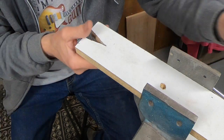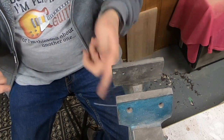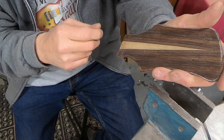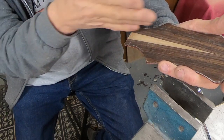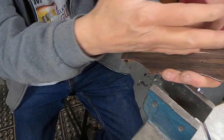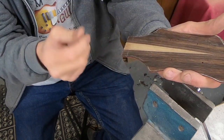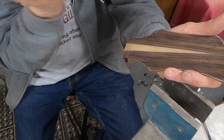I don't love cutting it with an exacto blade. The plus side is that these aren't extremely straight right here toward the end because I was having to angle my saw and I couldn't see it. But since this is about a half inch to five-eighths longer than it needs to be, all I have to do is file and straighten up the edge of the mortise, and then this white piece being the tenon I can shave the tenon until it fits perfectly. Because it's angled, I have room to make an adjustment there.